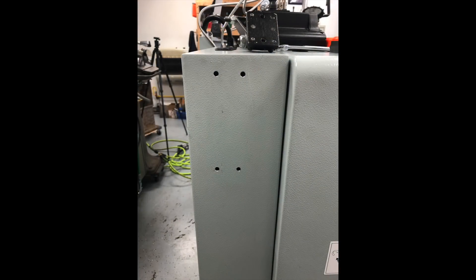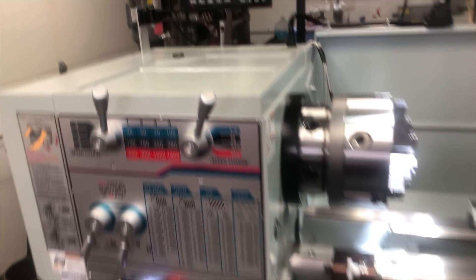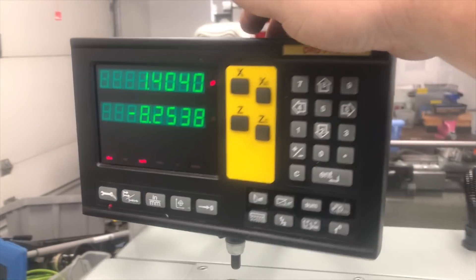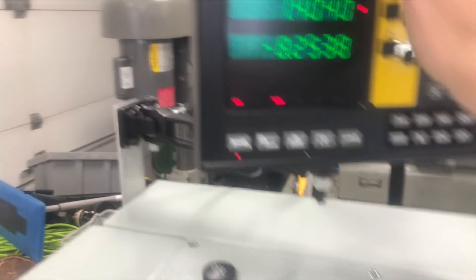Mounting the DRO head was really simple. I found a scrap piece of aluminum, drilled some holes, transferred those holes to the back portion of the lathe, drilled those holes through, and bolted the bracket right to the back of the lathe. The DRO head gets mounted to an adjustable arm. The way I mounted the arm to the bracket was I drilled a hole in the top and put a slot at the bottom. This allows me to adjust the DRO head and pivot it to make it square. DRO all mounted, everything all put back together, cleaned, even mounted the DRO head — it goes in and out nicely.